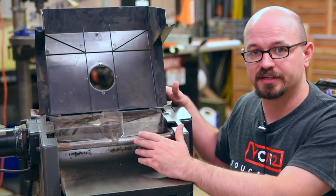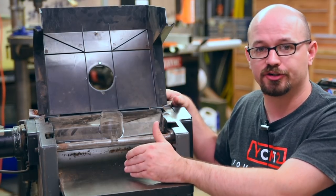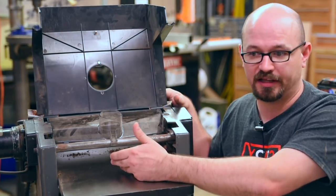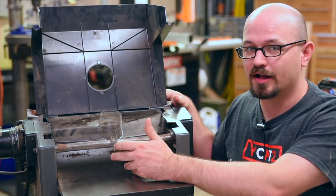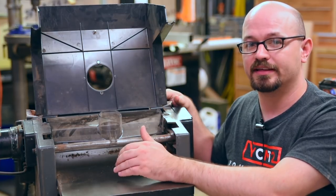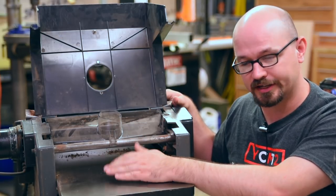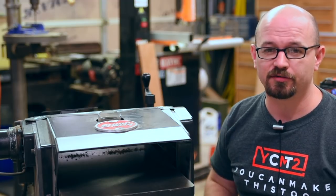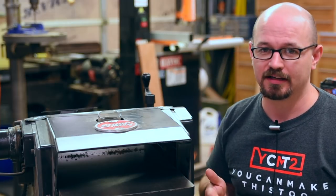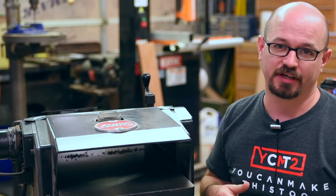These are also called thickness planers because their main job is to bring a board down to final thickness. When you take a board to the planer, it should already have one good face that you established at the jointer. Now if you don't have a jointer, you would do that at the planer. But if you don't have a planer, you probably don't have a jointer — and all the substitutions I give you will work to establish your first face and your second face, so no worries there. The thickness planer really is a one-trick pony that has a second trick, which is pretending to be a jointer. All it does is take a board that has one good side and makes the other side perfectly parallel to the first side and flat.